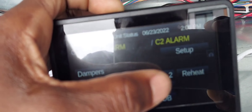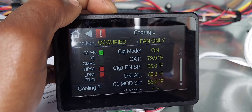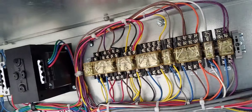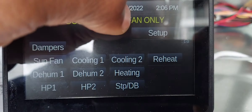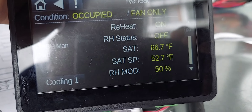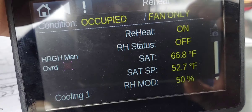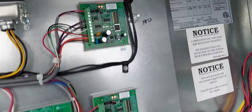Going back here to cooling, you can see the supply air temperatures. My supply air temperature is 63 degrees and it's 100 degrees outside. You can see the temperature — 78.7. It's actually going to go up since the compressor isn't running — it's going to get harder and harder. I hear the contactor clicking, calling for compressor two, but it's not going to run because I have it off — I want to finish the charge on compressor one first.